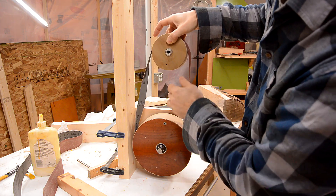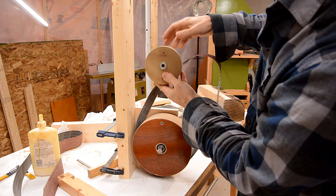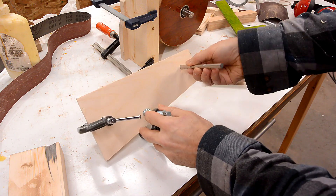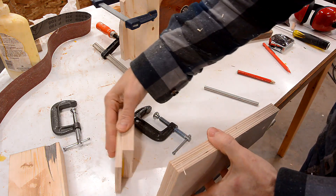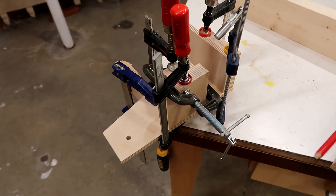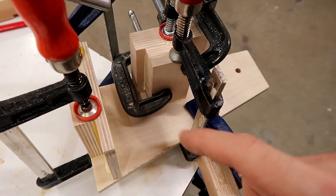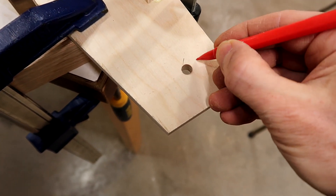The sander is supposed to accommodate different lengths of belt, so I think I'm better off making this bracket come out this way, so that as it moves up and down I'm still vertical on the front edge. These two pieces of plywood will make that bracket, and to make sure the hole is in both pieces in the same place I drilled them together. Now I just need to glue that together very precisely — I'm gluing this bracket one side at a time so I can get the alignment better, and I added a block in here to stiffen it against twisting.